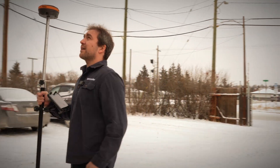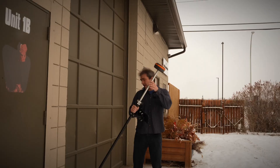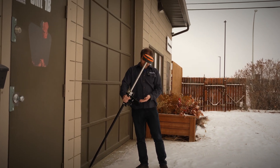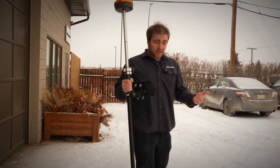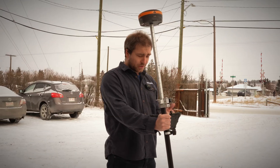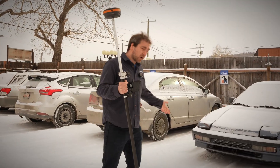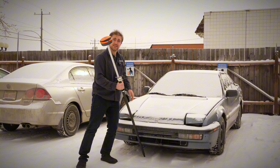So why do people like using the tilt sensor? There are some really easy reasons. If I've got to get a shot right here under an eave, that's usually pretty hard because you cut off most of your sky, but now I can tilt my receiver out and actually get a view of the sky and get a much easier shot — fixed at 15 millimeters on the edge of this building underneath the eave. It also helps with general pickup: if I don't have to level up my pole, I can just put my pole down, shoot a shot, and I'm good to go. And if someone's parked over your point, you might be able to get underneath and still get an accurate shot.